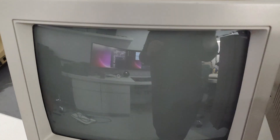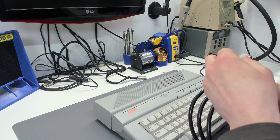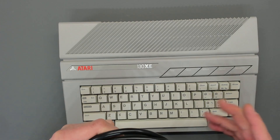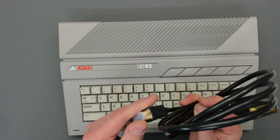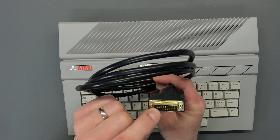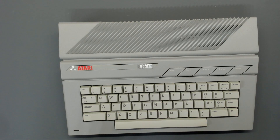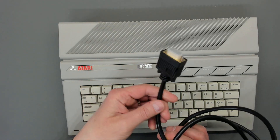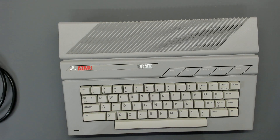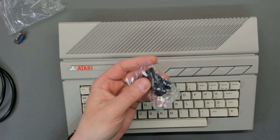But that's just a little aside anyway — that's why I got this monitor out. I initially bought on eBay a bare DVI-I connector, and of course I didn't check the listing carefully enough. What I actually received was a DVI-D connector, which didn't have the analog pins on it at all. Eventually I thought, well, the easiest way is to order a DVI to VGA cable, because that's obviously going to have the analog pins connected up and present. There's the analog pins — it's got a little blade in the middle for ground, and four pins around the outside for RGB and sync. So I ordered this cable instead.